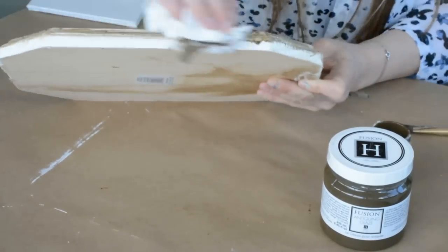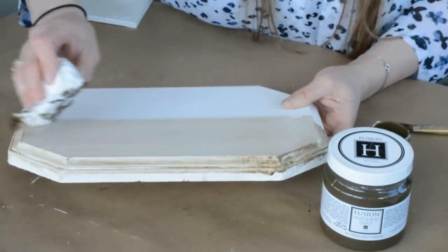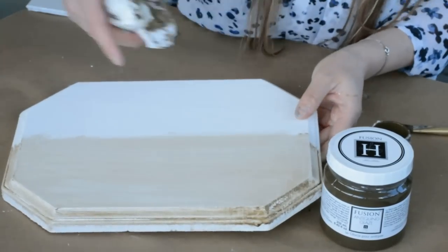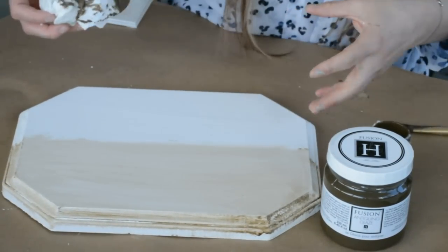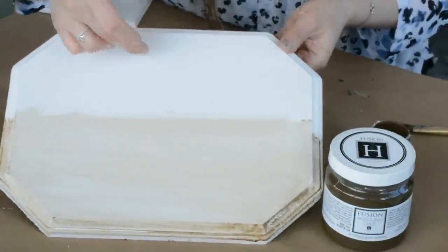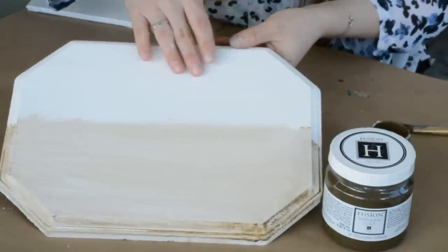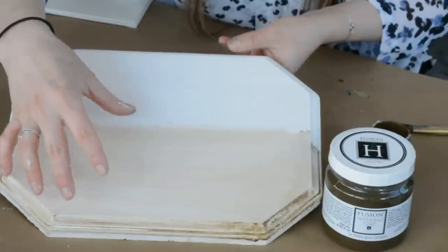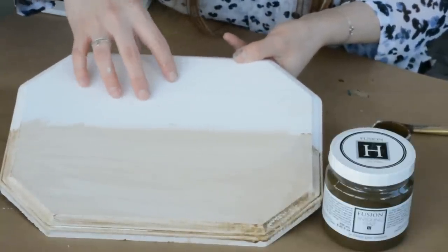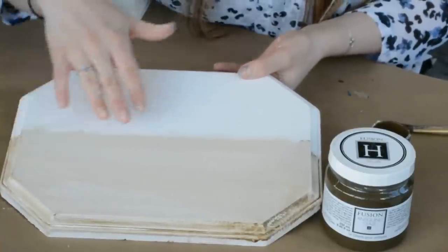I'm getting these edges here — it's going to be absolutely gorgeous. Now because I'm putting this directly onto a straight white, I am getting the highest intensity possible. If I wanted a lighter version, what I would have done first is added our clear tough coat to resist the pigment in this antiquing glaze from soaking in and absorbing into the Fusion Mineral Paint. But I went straight on with it and I'm very happy with the results.